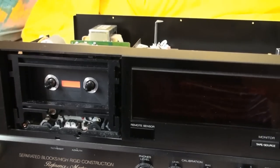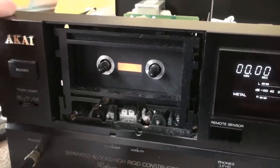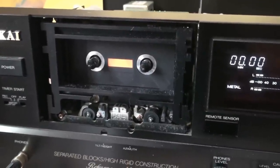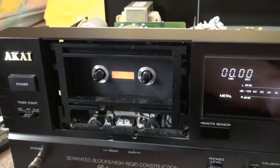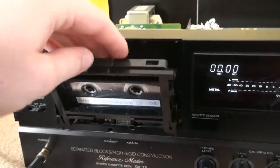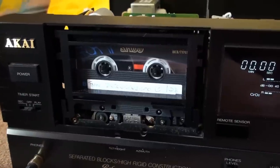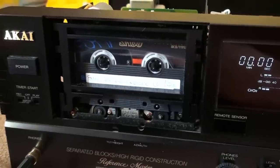As you can see, the cassette deck has been turned off. If I now go ahead and turn it on — look at that. The pause mode is basically the default. As soon as I turn it on, it goes into pause mode, and all the capstans are spinning. See it down there? If I go ahead and eject it, you can see it pops back into the stop mode just for this process. I'm going to put in a cassette and close it. There it is, back in pause mode, and obviously this is now going to start up in no time with a stable speed.